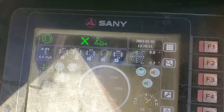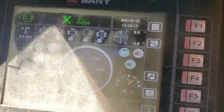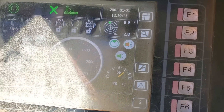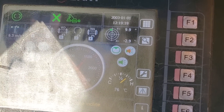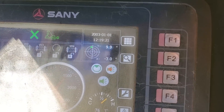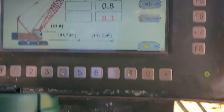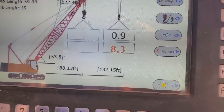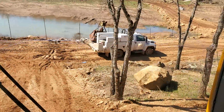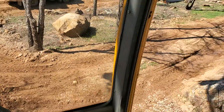We're still moving down the slope. Look at our boom angle — it's 55 degrees. Look at our capacity — 8,600 pounds. We want to keep that capacity up. If your capacity goes to zero you're going to get close to flipping over — you do not want that to happen. This is about 10 degrees of slope and we've lost about 11 degrees of boom angle. We're still above 8,000 capacity, so let's hop out and I'll show you what this looks like as you come off the slope.